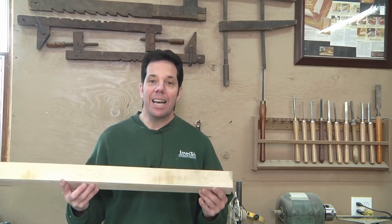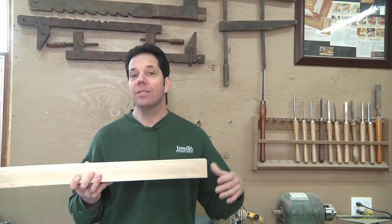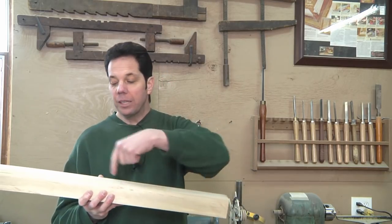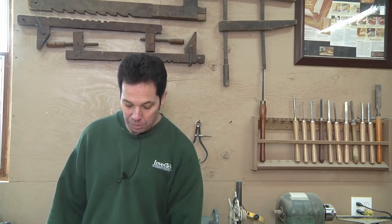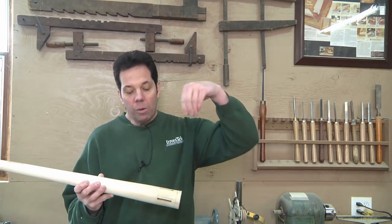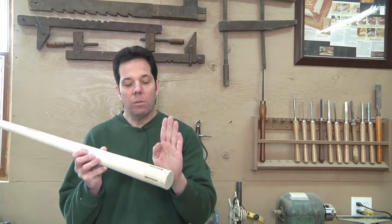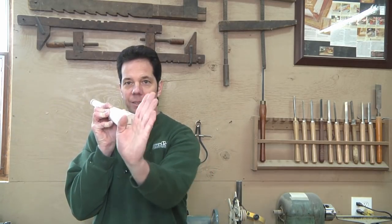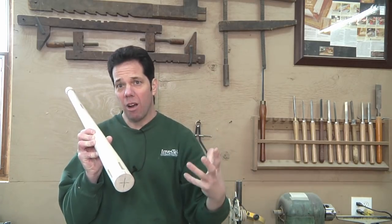Now when I built the desk, I started with the material in the square stock and I used the Domino Festool tool to make the plunge cuts to make the mortise. And it worked well, except for one leg, I had a little bit of problem. The problem was when I went to put the domino in it, it wasn't straight. It actually was on an angle, which means the plunge cut went in wrong.